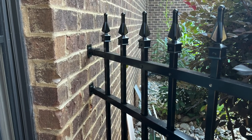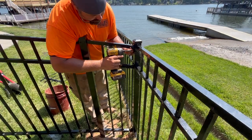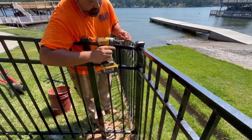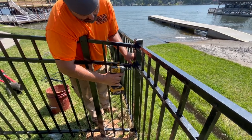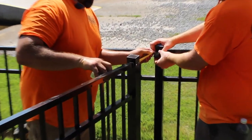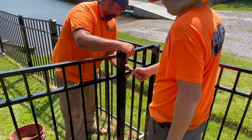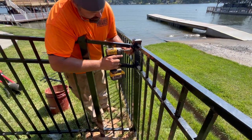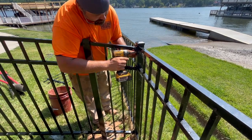The process is a little different if you are using wall mounts. At this point in the video, we are installing the cut panel into a post on one end and into wall mounts on the other. While holding a wall mount in place, measure from the face of the post to the inside of the wall mount, then add ¾ of an inch. This is the cut panel length. You only need to notch the end of the fence panel that is being installed into a post. When installing into wall mounts, you do not need to notch the fence panel.